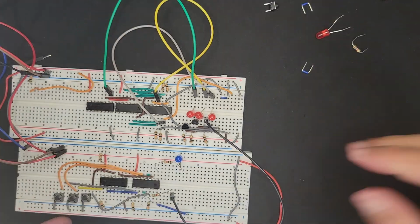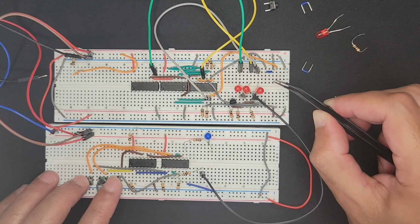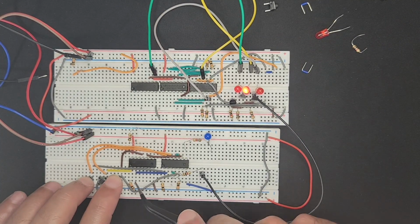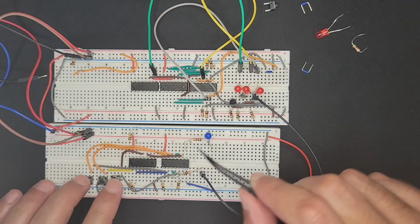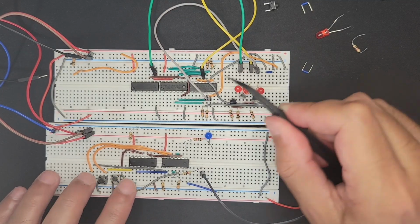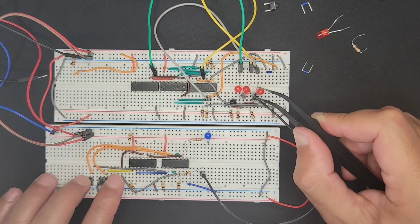So this is working really well. The add circuit, which has its registers populated, if we want to call these registers, the bits are populated, only functions when the instruction decoder receives the instruction to add. When we do the move, then nothing happens. Only when we have the add 1 0 1 being processed in the decoder does the add actually fire off. So we're not constantly having the output being pushed now. It's only pushed when we need it.